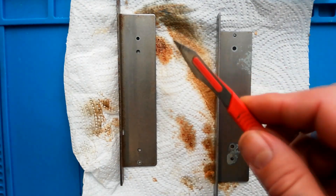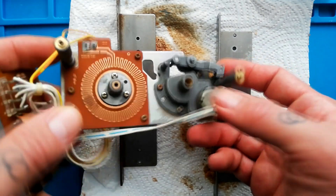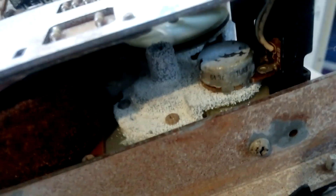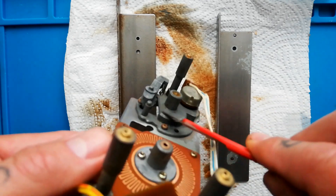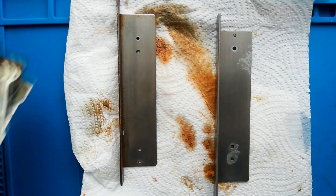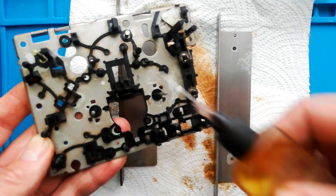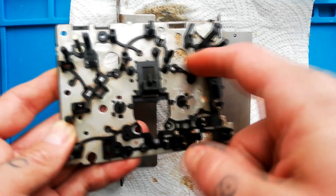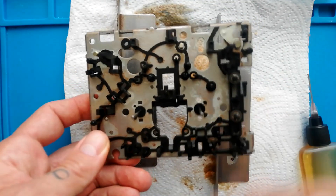Anyway, that's been my method. The good thing about the scraping with the scalpel idea is — I'll try and cut in some footage of what this mechanism from the MG614 looked like before I got at it with the scalpel. I've really only ever seen that kind of rust on a car that's been left to rot in a scrapyard before. Most of that was cleaned up just by getting in with the scalpel and the oil. Likewise, this was very rusty and I've mostly cleaned it up by applying that and going like this. To get around all the plastic parts I just used a Q-tip to soak up the excess oil — fiddly mechanical parts, I've been able to refurbish pretty successfully using that method. Anyway, I hope that's helpful. Thanks for watching — hope to see you again soon.